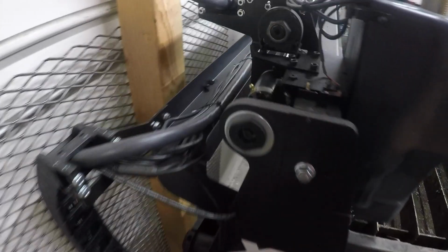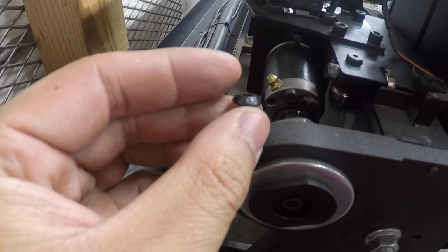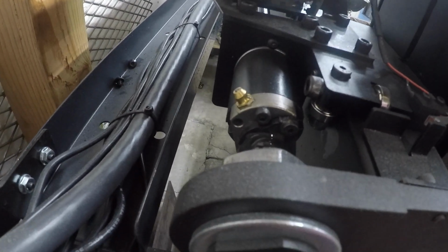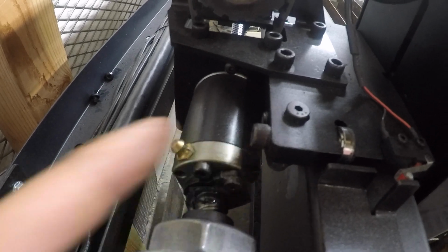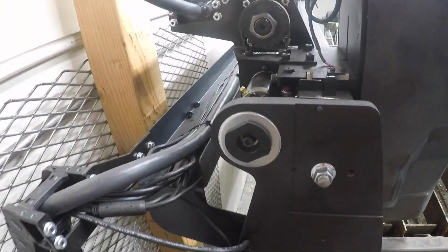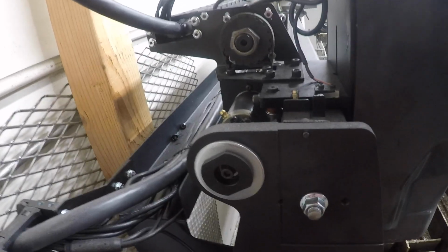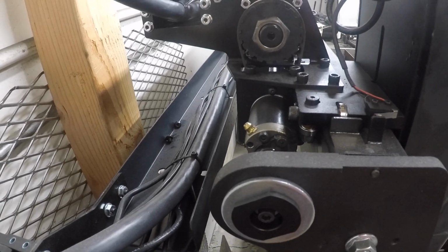Like I was saying at the beginning of the video, these ball screws came with a set screw and it made it really hard to grease these bearings or ball screws. So I got the Zerk fitting, but the Zerk fitting currently hits this nut or screw sometimes, and it's really hard to grease, and the bottom one down here. So while I'm here, I'm going to go ahead and replace these really quick.